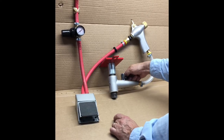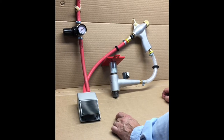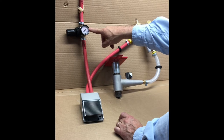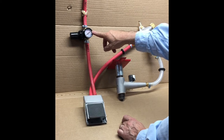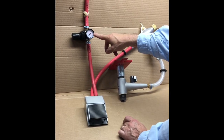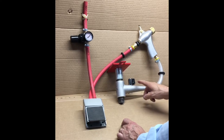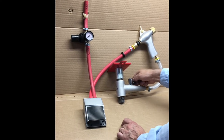So how do you set this valve up? What we've seen is that most guys are putting much too much pressure to the system — trying to blast at 80, 90, even 100 or over 100 pounds PSI. That's much too much pressure. In general, the sweet spot is between 40–45 pounds on the low side and roughly 60–65 pounds PSI on the high side. The first thing we want you to do is determine the best combination of PSI and the best setting of the air bleed valve.